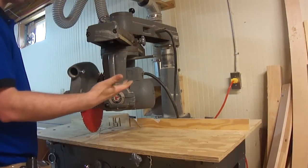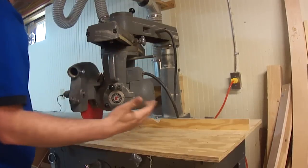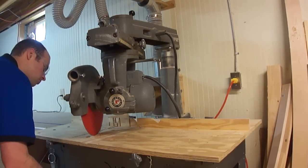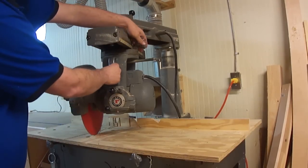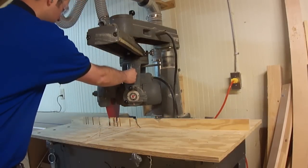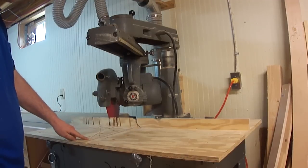Lock that in place, so now the motor can't slide side to side. What I can do is turn the motor on and slowly lower the blade down so it's just below the surface of the table. Again, you want to make sure it's locked in place so it can't go anywhere. So if I turn it on, so once I had it down so it was just below the surface of the table, I unlocked the clamp